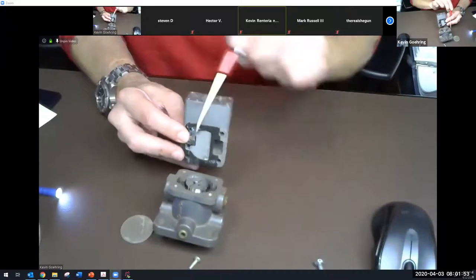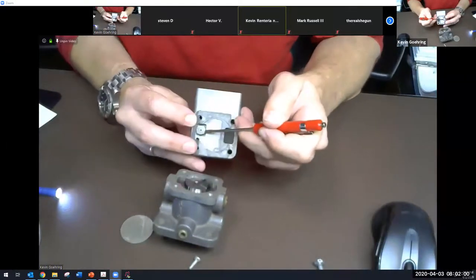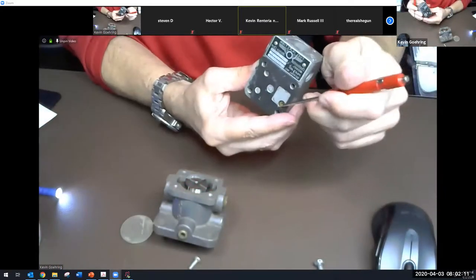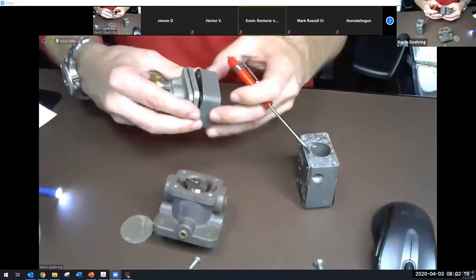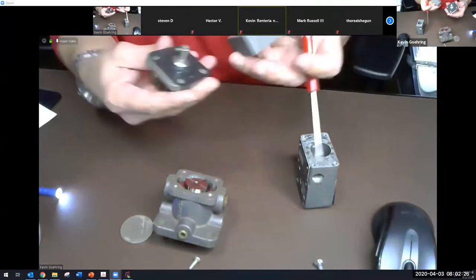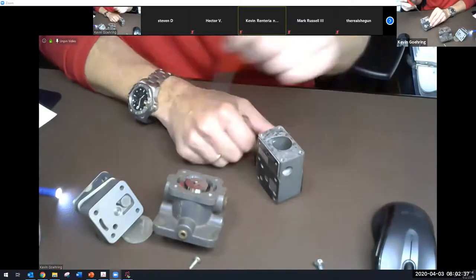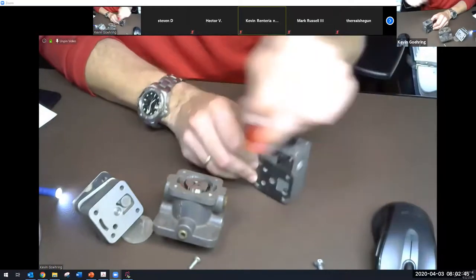So inlet side of the pump, around the pump, through this way, and now it's got two choices. It's either going to go out here to the fuel control unit, out of the pump, or it's going to come through here and then go into this chamber. And right there is that little orifice on its way back through here. Hopefully you can follow. I'm just not going to make it real difficult on you guys. It goes into this chamber where it's got the diaphragm and the low end diaphragm relief valve. If this is open, then it finds a path back through there, back into the inlet side of the pump and swirls around. So that's the return path: from that orifice, relief valve, back, swirl chamber, and to the pump and around.